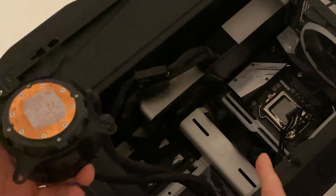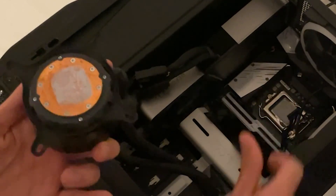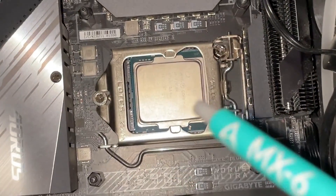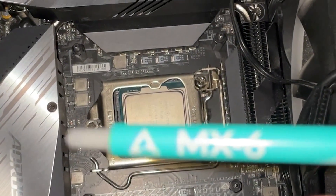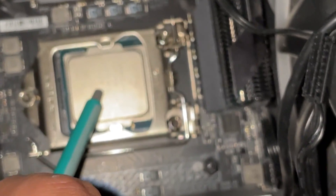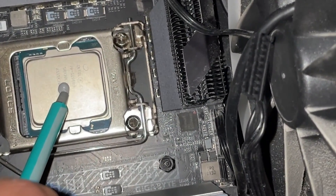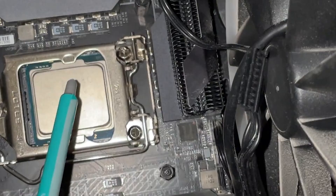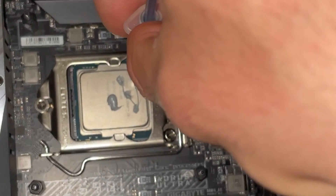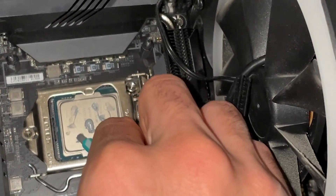As you can see, perfect paste application on both sides — both on the CPU and on the cooler — and the paste is still fresh, so it will be a perfect comparison. Here we are with a proper close-up of the MX-6 application. What I like to do on Intel sockets is just the dot method — I put a single dot in the middle of the CPU, properly applied, and then in order to clean up the syringe, I just kind of slap it around the die a bit.